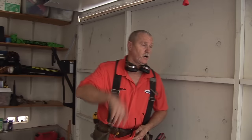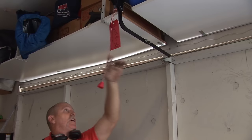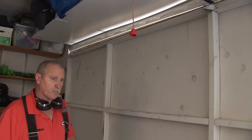So basically to summarize: hardware is installed, it's buttoned up on both sides, no springs, still attached to the arm on the opener. I didn't need to mess with that yet and I was able to utilize the trolley to lock the door from falling back on me. Still got a little bit of work to do with maybe the truss rods tightening them, but the hardware is installed.